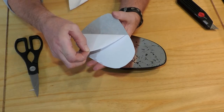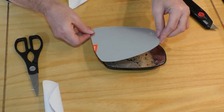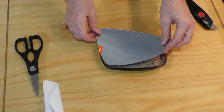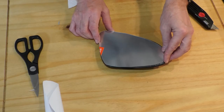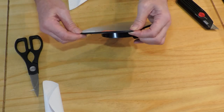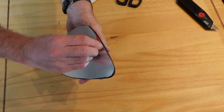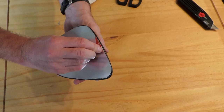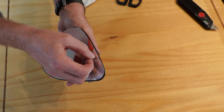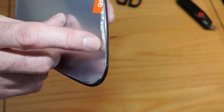You can then peel off the white backing on the glue side. The glue is quite strong and glues very quickly, so make sure that you get the easy fix mirror in the right position first time and then press gently to make sure it's glued in place. The reflective side has a protective film — do not remove it at this stage, but just peel back a little bit so that you can easily grab it and pull off all the reflective film later.